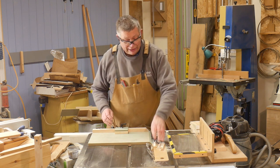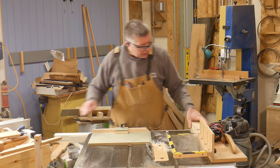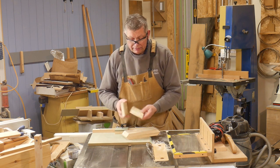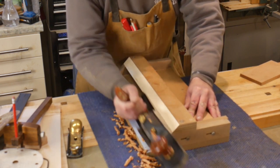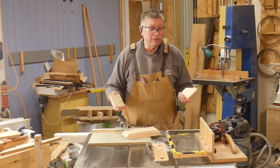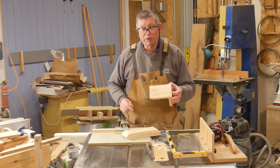You can see just how important it is not to let waste and scrap pile up on your table saw — it's very easy for it to get kicked back. So now I've got the four sides of my box and they are pretty much exactly the same length, and this pair is also the same length. I would actually shoot these on a shooting board, but for something fairly crude — just a workshop box to keep tools in — you wouldn't even need to do that. What we do need is something to strengthen that joint, so the next job is to get the other jig set up correctly.